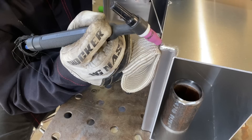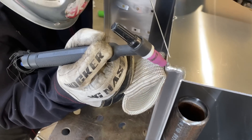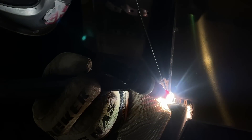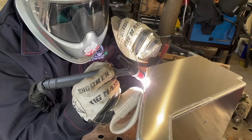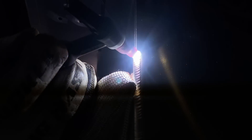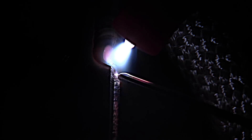Here's a quick tip: sometimes when you're welding aluminum on the bench it can get to chattering. That's why there's a little counterweight inside - just a piece of pipe. If you don't have a weight on it and it gets to chattering while grounding on a steel table, you can wind up with some pretty bad arc strikes. This is a really good example of where pulsing with the pedal is a benefit - Brad is really wrapping those corners, wider than you'd normally do a bead on 090. But he's able to use a lot more heat, wrap the corners completely, consume any tacks so they're not visible after welding, and pretty much fully penetrate the outside corner joint.